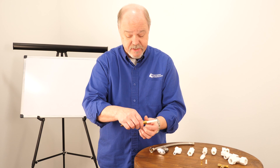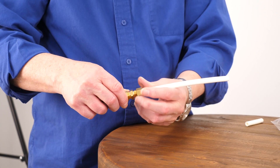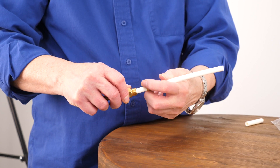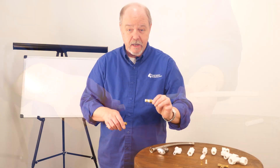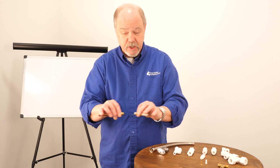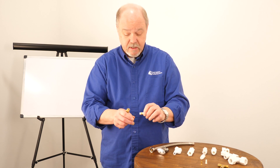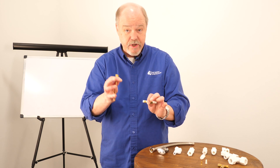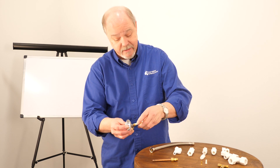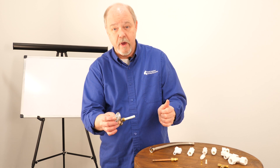To take them apart, you just reverse that order — undo the nut and typically you can pull the tube out, though that little sleeve is probably stuck there. Unless you're putting it right back into the fitting, if you're changing the connection by any means, there's a good chance you're going to have to cut that sleeve off. But if you're putting it right back into another compression fitting — say onto your angle stop — you can leave the sleeve there and just use it again, because the compression fitting will work the same way.